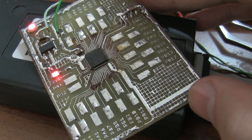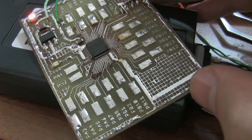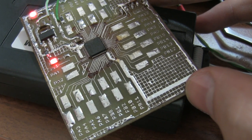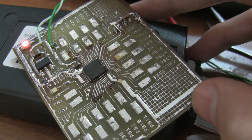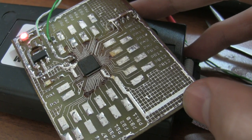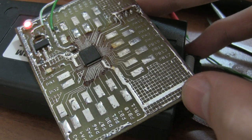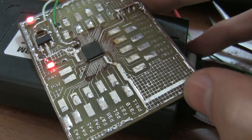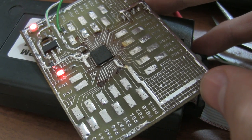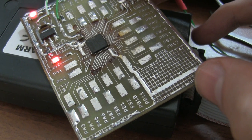Without any fancy routing, made at home — you don't need to order a PCB, you can just do it at home using your iron and a laser printer. You don't need reflow soldering or even air soldering; you can solder everything using a regular soldering iron. So it's probably a good time to start looking into ARM and start learning.